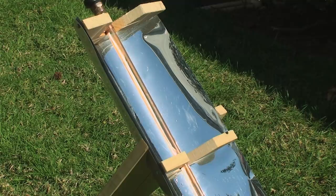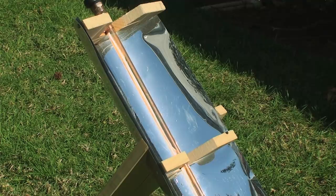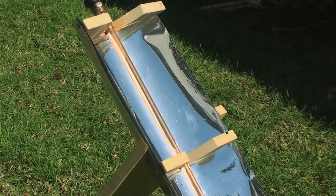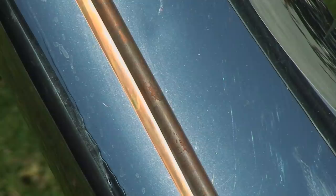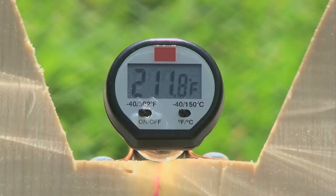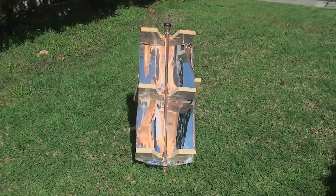Very fast indeed. As we can see in this shot, the underside of the pipe is illuminated by the concentrated sunlight from the reflector, much brighter than the front side of the pipe. Because the sunlight concentrated onto the pipe heats it along the entire length, nowhere is this pipe going to be cool enough to touch without being burnt. There is a tendency to want to grab the pipe and use it like a handle — rethink this. Even though it does not glow, consider the pipe the same as a red hot branding iron and treat it as such. If you think it looks hot, it is. Caution: this water heater gets very hot. In fact, this heater has reached 212 degrees Fahrenheit, which is the boiling point of water. Keep this very much in mind at all times when making and using devices of this type.